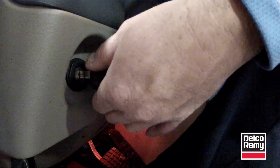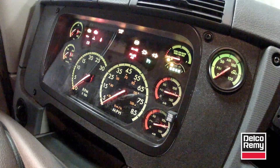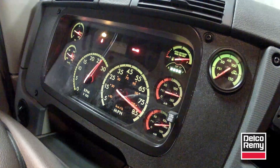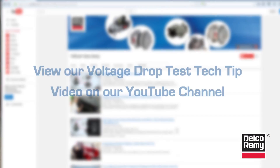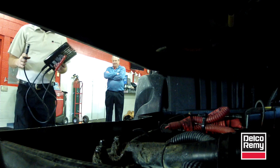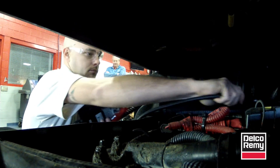If you are utilizing remote sense, the alternator could be in excess of 14.5 volts. It is important at this step to do a voltage drop test between the alternator and the battery bank on the alternator charging cables. Once all these tests have been performed and the alternator is found to be the root cause, proceed with replacing the alternator.